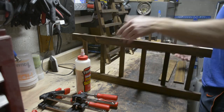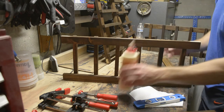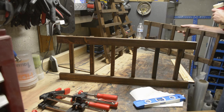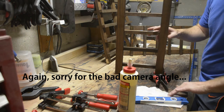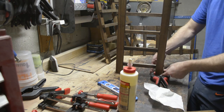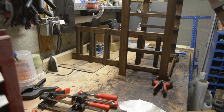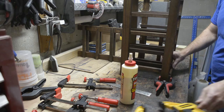Next it's time to install the fronts and get all the towers positioned. You're going to need a nice clean, level surface. Start by laying out the better front pieces and deciding which side of the towers will face out. Grab some glue and apply it modestly to the bare sections of both the towers and the fronts — give glue to both pieces so you're not starving one side. Put a clamp on the first joint, get the tower perfectly vertical and the front perfectly horizontal — you want a nice square edge.